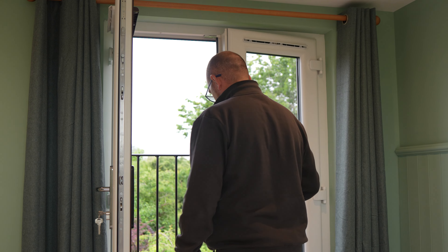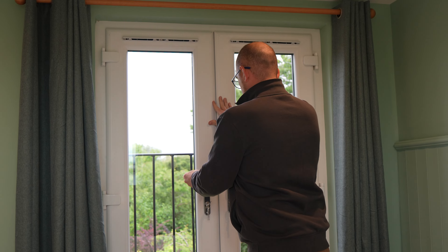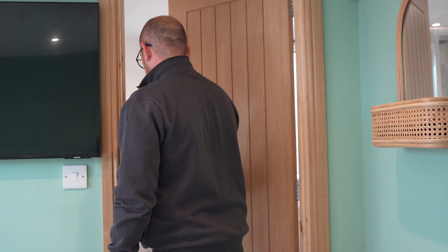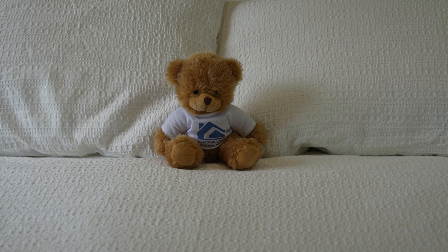A dead giveaway is to look at the doors and how high they are to the top of the roof — that gives you a sense of how much usable space there is. On higher lofts you'll see a large section above the doorway, but here because it was on the lower side we didn't have the luxury of a really high Velux conversion, so this forced our hand for a dormer. As you can see, having the dormer with the large flat roof gives a lot more usable and beneficial space, especially if you're looking to create a bedroom up here.